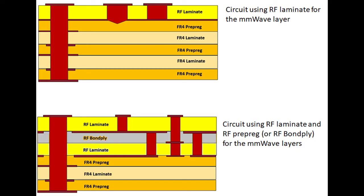As time has moved on and we've learned more, there's a need for higher resolution radars at these very high frequencies. To support that, these circuits have to be more complex, so now you have more RF layers. The bottom left picture shows an RF laminate on top — probably still microstrip or grounded coplanar waveguide — and then copper layers two, three, and four actually form a stripline structure, giving more utility for processing RF signals. Below that again is FR4, usually high TG FR4, capable of going through lead-free and other assembly demands. These two cross-sectional views show why a good prepreg is needed with very good millimeter wave performance.